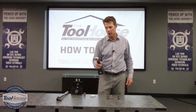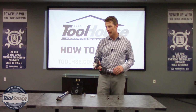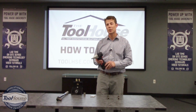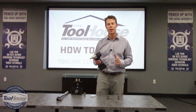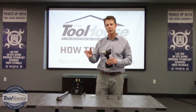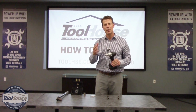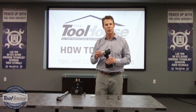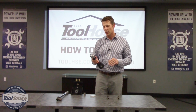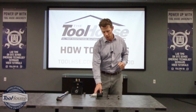These tools are really good as general rundown assembly tools that shut off. They give great feedback to the operator. They're accurate to about plus or minus 10 to 15% on the right joint. I'd recommend using these tools on a really consistent joint. If you have a hard joint and a soft joint, where it varies quite a bit, then you may want to go to more of a direct drive type of tool. But for that general assembly where you need feedback, this is a really powerful tool to use.